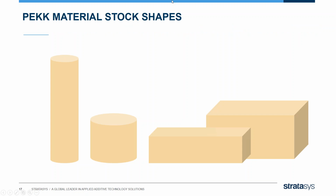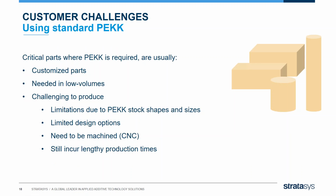In other words, what is the PEEK? PEEK normally comes in different shapes. So this is a cast material in blocks or in other pre-produced shapes. And these are the options the manufacturer has, and they can mill and turn these preform shapes, and we give them the opportunity now to print the parts directly and have no waste anymore with this production.